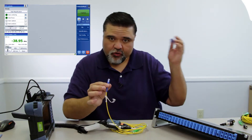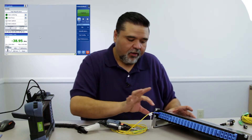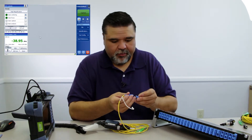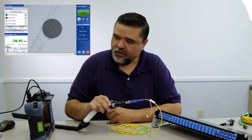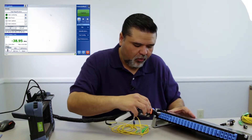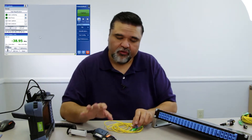That's a cool trick using the bulkhead inspection. Normally I did a no-no here — I didn't clean the connector before plugging it in, so I can get cross-contamination — but for demonstration purposes that's all right. So if I want to inspect and clean this connector, I'll unplug it from the patch panel, grab my little bulkhead tip, plug that in, and inspect the tip. We'll be able to see this again, and I can have it refocus and recenter. Now we're seeing that tip, and if I want to look at the actual bulkhead itself, I can plug it in and you can see there's quite a bit of contamination here as well. It's pretty nasty.